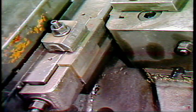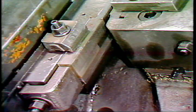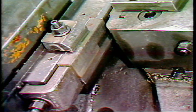The first die adjustment is to adjust the die height. This adjustment consists of changing the packing under the moving die until the top of the moving die is level with the top of the stationary die. If one die is higher than the other, the blanks will be rolled with uneven pressure, which will cause unacceptable threads under the heads.